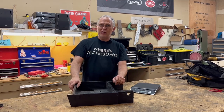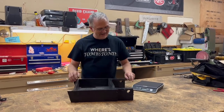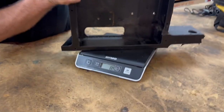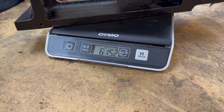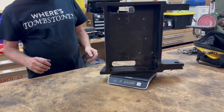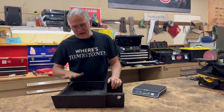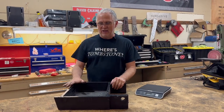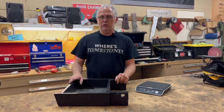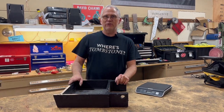So with all the machining to get it ready for combat — what did I end up with? Remember, it started out as 70 pounds. All said and done — under 7 pounds. That is a lot of plastic shavings. I was really happy with the way it turned out. I'm convinced that in the smaller categories, building from a solid block of UHMW is a great strategy, and I'll probably continue to use this going forward.